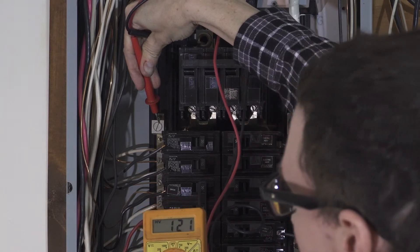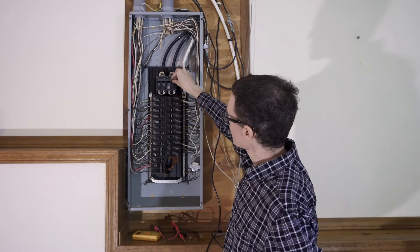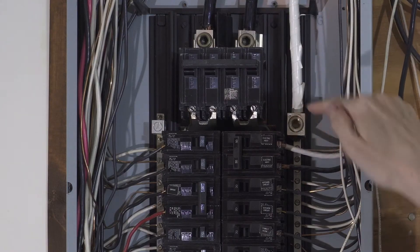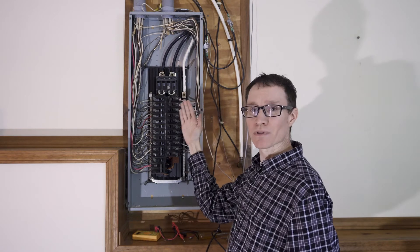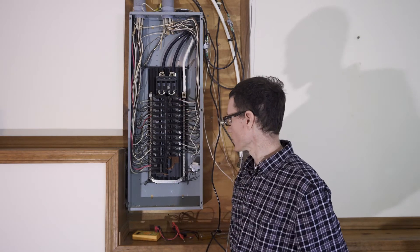For the left hot, it's 121 volts RMS. We have the main circuit breaker here for the house, and if you look just below the main circuit breaker you can see two bus bars extending out from the bottom. Those are bonded to two copper plates which run behind the branch circuit breakers.